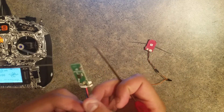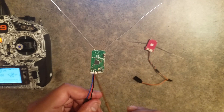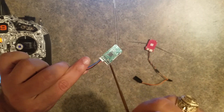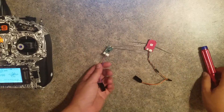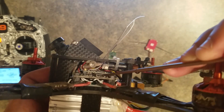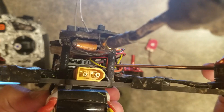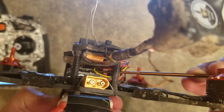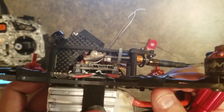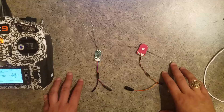If you like making things really compact, we have standard servo 3-pin mounting holes so you can carefully tear off the connector and solder this straight to a flight controller that has the same 3-pin connector. Here on my quad I've got the flight controller right here and the receiver right above that with some double-stick tape to keep it separated. You can see the 3-pin connected and soldered straight in — nice, neat, and compact. It's not integrated into the flight controller but it's a close fit.